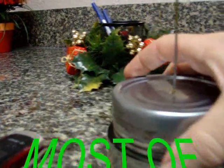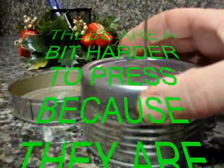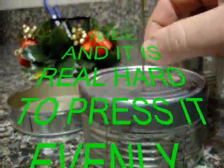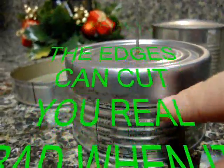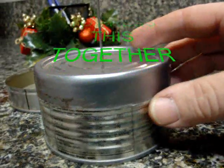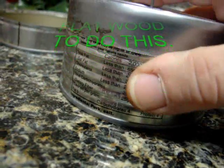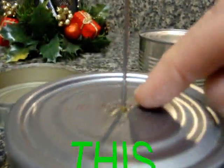This will sit down and fit where you want, acting kind of like a funnel. The outside piece of the tuna fish can slips over the outside and I had to press that down very hard. I've run this wire all the way through. Just before I push this down all the way, I put some epoxy on the insides of the ridges and then push this down over it, then I put a little bit more. That makes this seal at the very bottom. I just bent this sharply and then loaded the epoxy on the bottom. When I set this down, I don't want that wire to touch — see, this doesn't rock, so that wire is not touching.